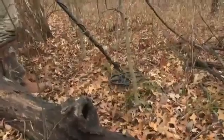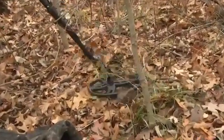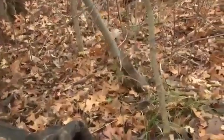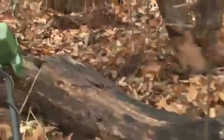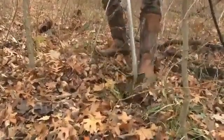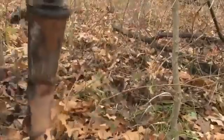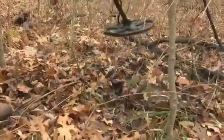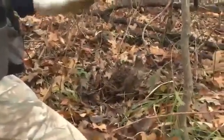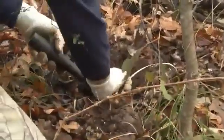There's something right there reading about seven and a half. One thing I can do is kind of wiggle it and pull back — now I've lost the target. As I scoot forward it should be right off the tip end of that coil. Let's see if that holds true — dig a little circular plug right through all these roots, right where the tip end of my double D coil was, and push it back. That's the beauty of the double D: get the wiggle going, pull back until you lose the signal, then move forward and get right off the tip.